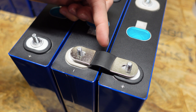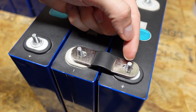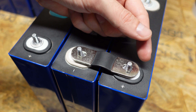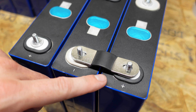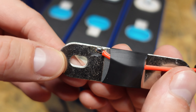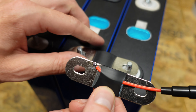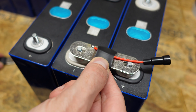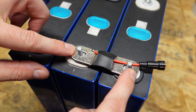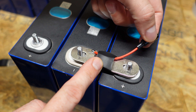The other problem I was dealing with was how to connect the balance lead to these bus bars, because I really didn't want to put the ring terminal underneath the serrated flange nut. What I ended up doing is using a rotary tool to sand off a little bit of the nickel coating, and then I was able to easily solder on my balance lead and my fuse holder. Now wherever there's a series connection I just set this down, tighten down the two nuts — no worry about the ring terminal going under the nut — and I'm able to attach my fuse and my balance lead.